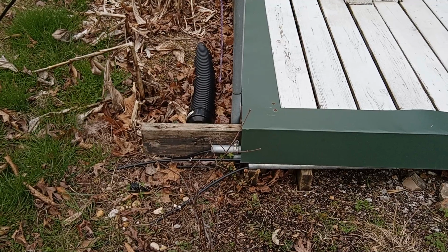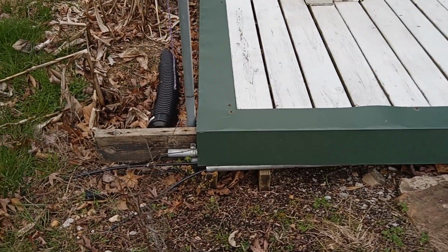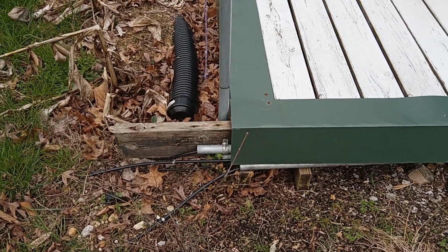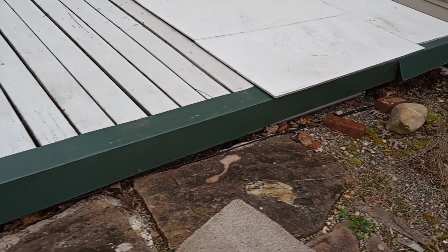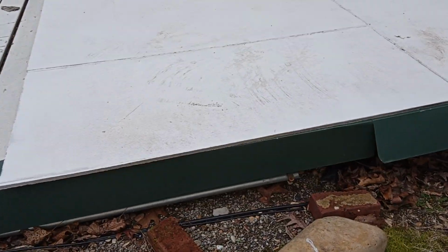So what I've done here is run transmission lines, most of them, through 10 feet segments of galvanized steel conduit. Steel has an extremely high permeability. It's essentially extremely lossy. So I run those through 10 feet of that conduit. It's hidden behind that green fascia, but here's the other end of one of them.